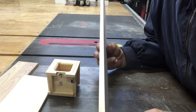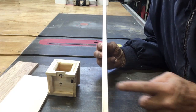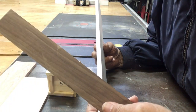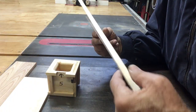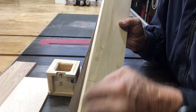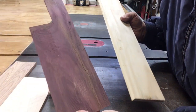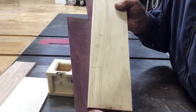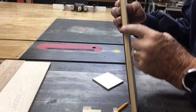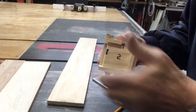But what would happen if you took a piece and you had a 1/4 inch piece? You drilled the holes all the way through. Then you took a piece like walnut, say an eighth of an inch, and you glued it on the back side. Then when you look through the hole, you'll see the walnut. Or even, which would even be nicer, you take a piece of purple heart and put behind it. Also, see the wood on the sides, that eighth of an inch. And that would wrap around the whole box.